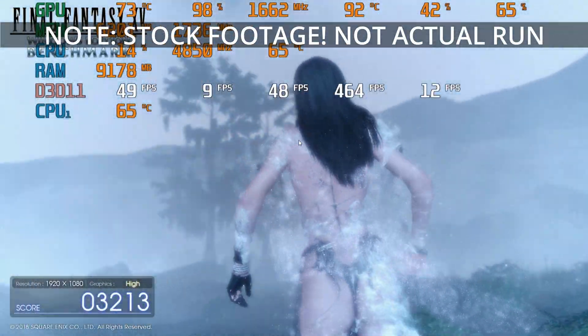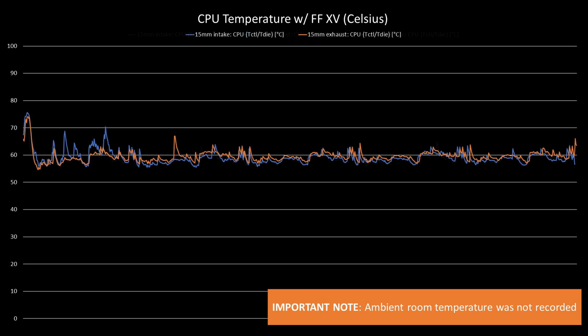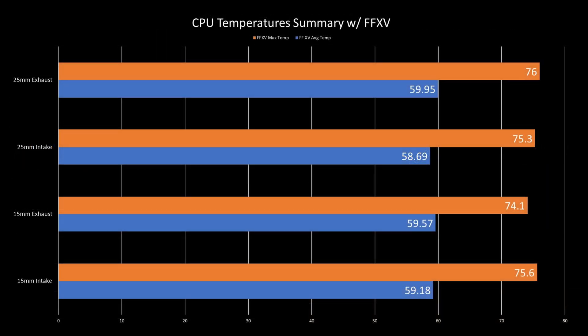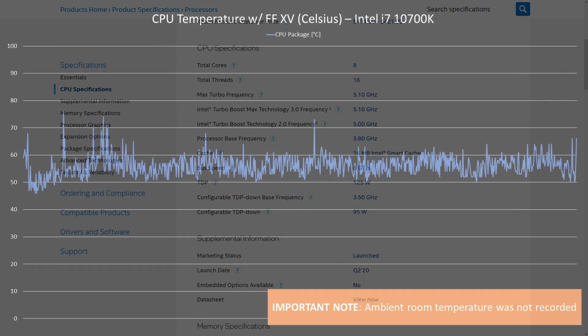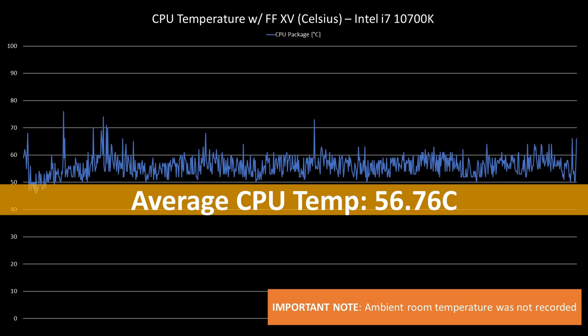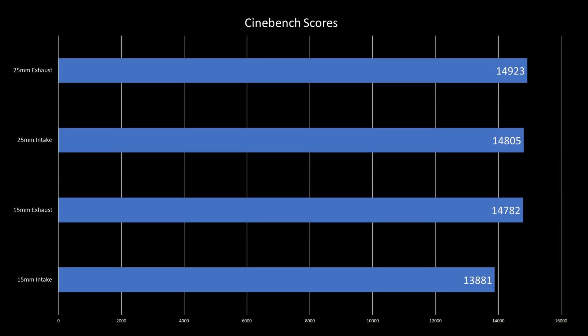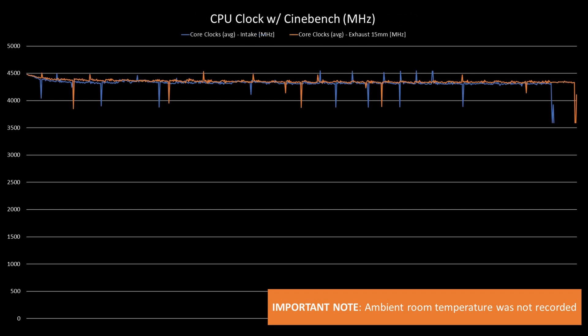As for the temps, I tested the FF15 benchmark for 30 minutes. It performed well in its default config — 15mm slim fan intake. It also performs similarly with 15mm slim fan exhaust and a 25mm Noctua fan exhaust. In all configs the average is around 60°C with a max temp of 74–76°C. I also tested it with the theoretically hotter Intel i7-10700K: in default config it averaged 56.76°C with a max of 75°C. As for Cinebench scores, there is an outlier of 13,881 but this is likely due to background processes — average core clocks compared to non-outliers look as expected.